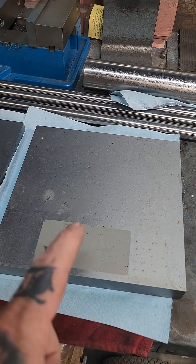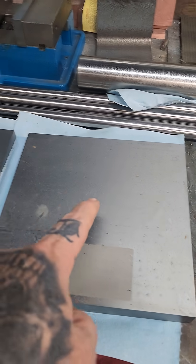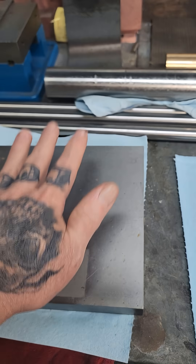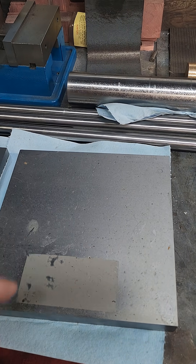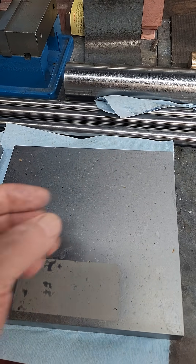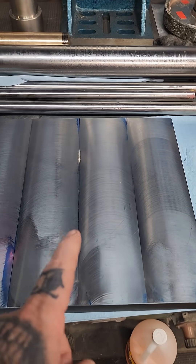This is the actual mold plate — one and two. This is going to be made up like so. These are precision ground; I don't need to do anything with those. This plate will be bolted to this plate, and that plate to the other plate, so the mold machine will open and close constantly. This face needs to sit flat and flush against that face, so when the cavity — which is going to be machined in there — has material injected into it, it doesn't come leaking out because the mold plate isn't mating up properly. That's why I have to have this flat.